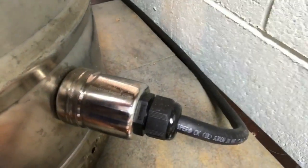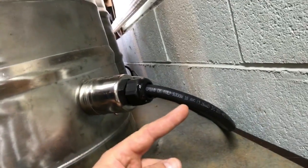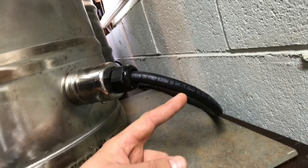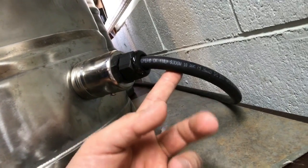The best one I found and the sleekest and nicest is something made by BrewHardware.com. Bobby from New Jersey — that's his handle on YouTube, you can look him up — sells something called a hot spot or hot pod. I'm going to show you a real clean, nice way of containing your heating element and keeping it secure. I have a 10 gauge three conductor running into a squeeze connector that will hold this nice and firm.